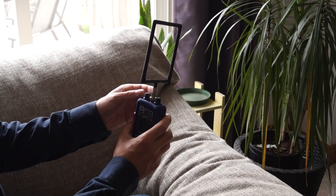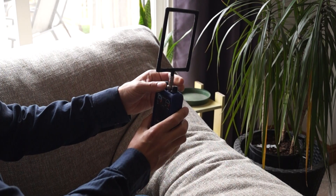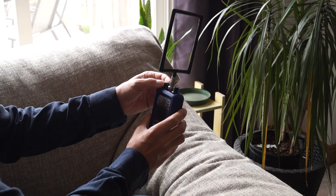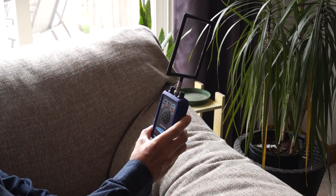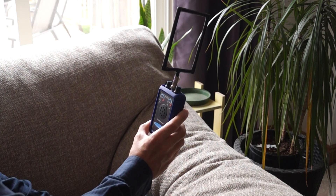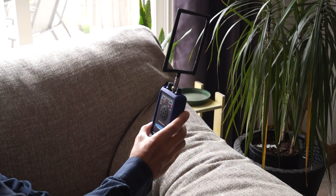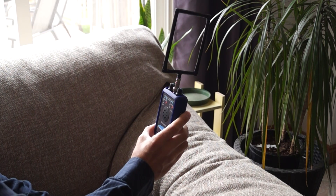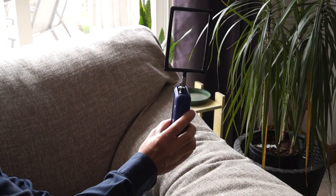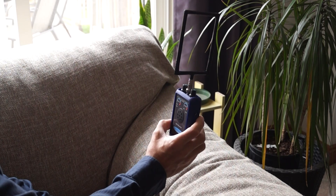With the AR1 on, adjust the antenna position so that it has no feedback. Adjust the power and volume controls until you can hear the clicking in the background — that is the distant clicking of lightning bursts, perhaps 1000 kilometers away. By rotating the unit, the electromagnetic interference will increase or decrease, so find the place where that interference is minimum.